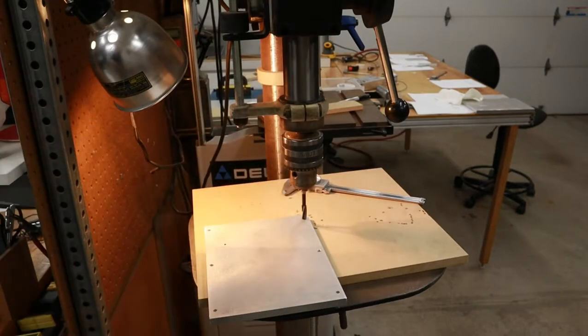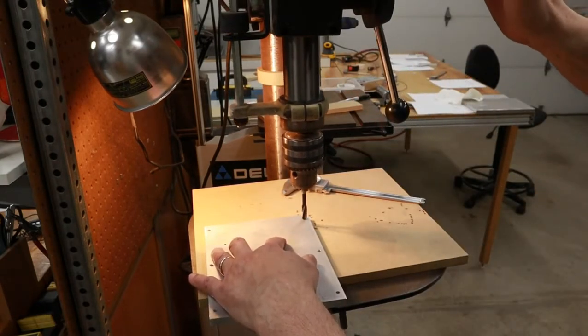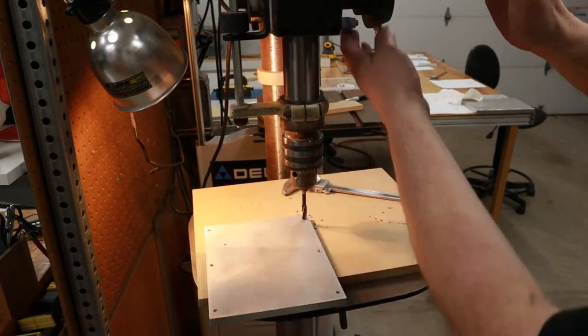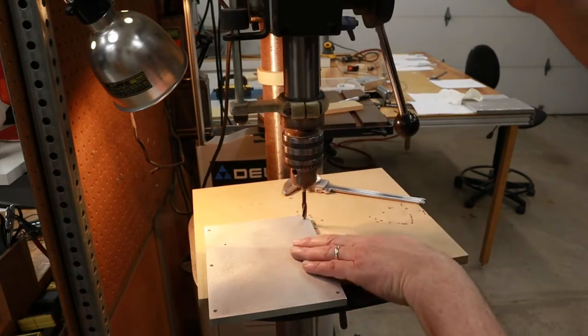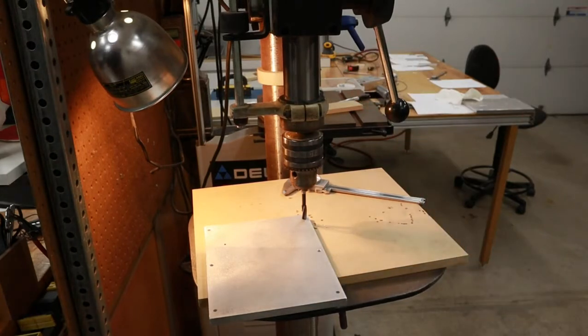Now what I've done is I've lined it up with the hole. I brought the tool down into the hole, the pilot. You'll notice it's got a pilot diameter there. That's in the hole, and now the shoulder is touching the face of the part.